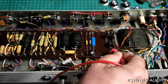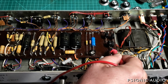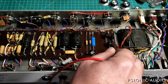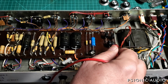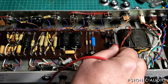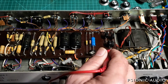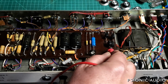And the issue I'm having is that the DC supply cuts in and out, and I don't know whether it's a wire. It's not soldered on the bottom, but I suspect it might be this diode, because when I was pressing on them, the power came in and out when I pressed this one, and I think I just pressed this one just the magical way so that the power is staying on. So I'm going to take it out of standby.